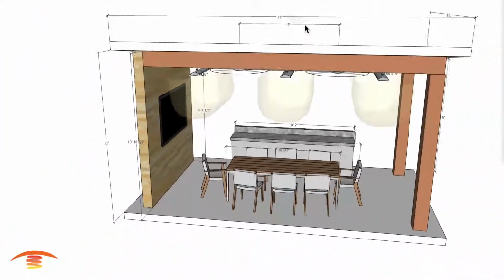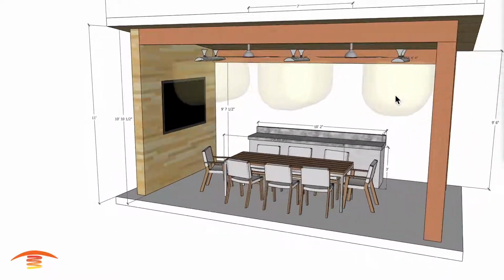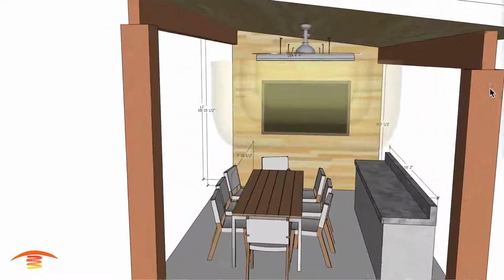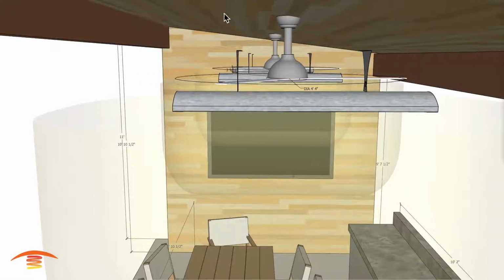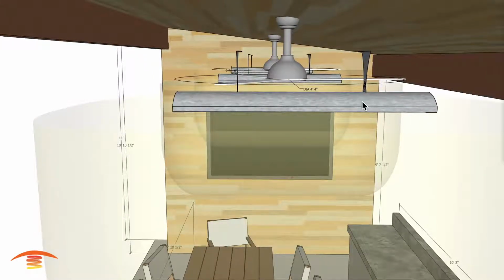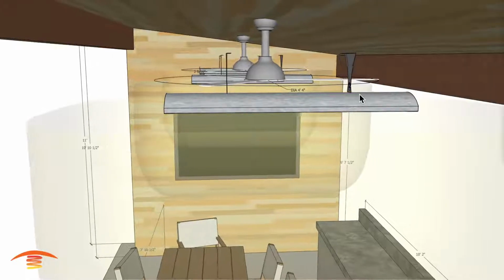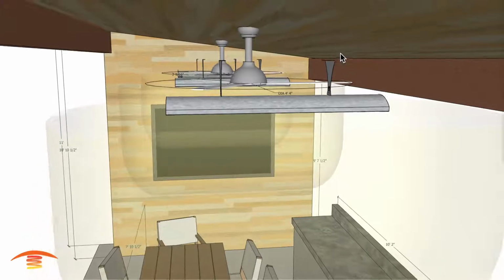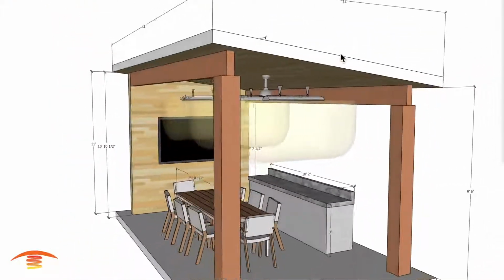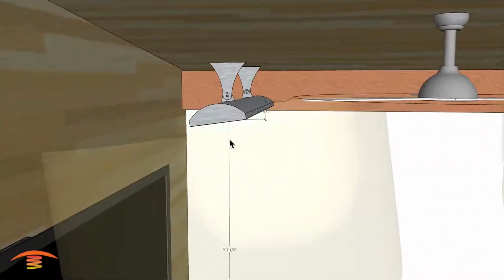All right, so again, that's a 7-foot center to center on that, and you can see that we got all of our clearances met with regards to that. Now, another thing you'll notice is I've dropped it. So instead of using the OEM bracket, you might want to just use a chain and just locate the chain up here into the ceiling, and then drop the electrical down with that chain on one side. Probably the back side would be better, or you could use a steel bracket and then just design your own bracket so it just comes straight down, maybe like a 1 by 1/2 channel, or 1 by 1/2 tubular steel, something like that, and then just mount it into this hole here, and that way you can achieve your angle over here a little bit easier.